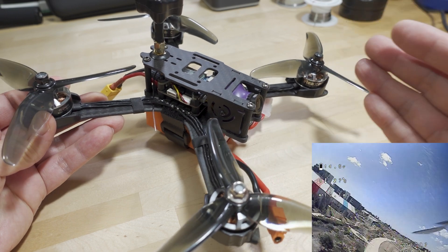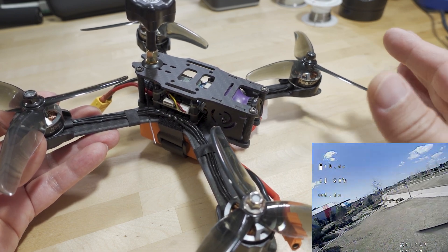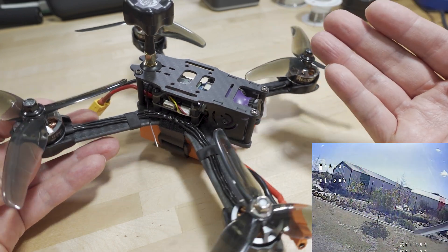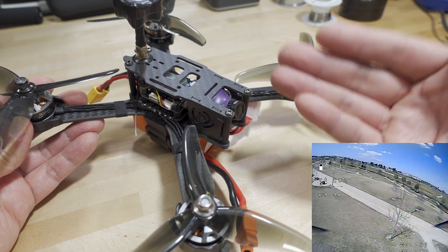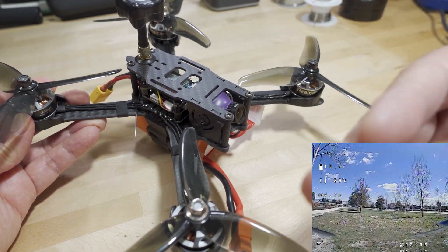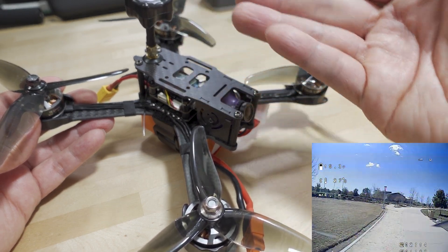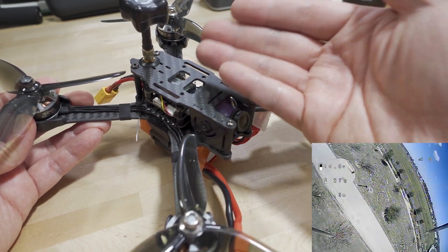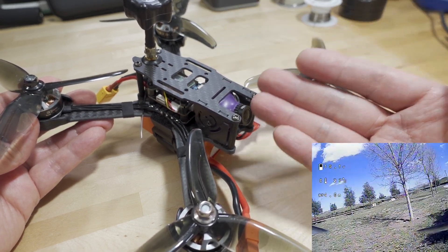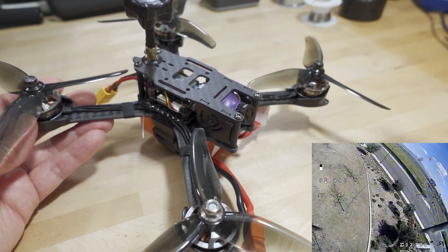You're not going to get a lot of support from that store - they may respond to an email here or there, but for the most part you're on your own for setup. It's not that difficult if you've done FPV drone setups before, but if you're a beginner you may find it pretty difficult. I'll link a general setup tips video in the description. Basically, you need to add a receiver and solder it on, bind it to your transmitter, make sure receiver and transmitter match, and tune your goggles to the correct VTX channel - mine came on race band 1.